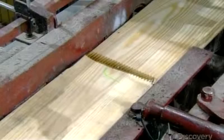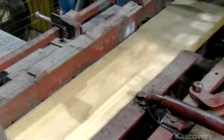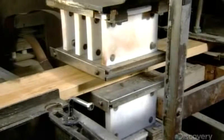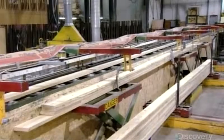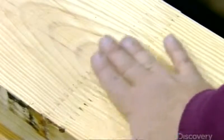Workers line up the glued boards in a machine called a crowder. The machine's pressure rollers slide one board into the other, interlocking the finger joints. Then two plates clamp down on each joint, rendering the adjoining boards flush, should one be sitting slightly higher than the next. About 15 seconds of heat cures the glue, and the connection is barely visible because the glue dries translucent.